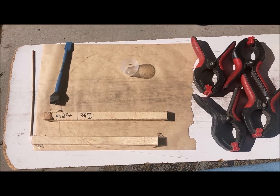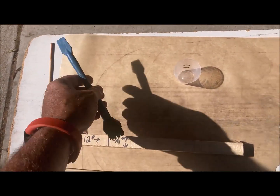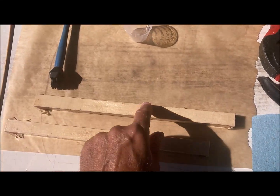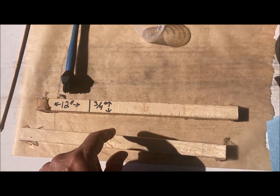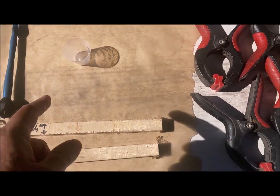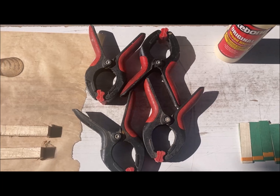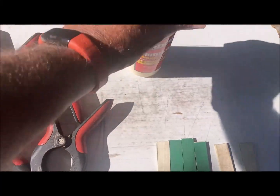Let's look at what we're going to need today to clamp up our logs. I have a brush here. You're going to need a measuring cup. You're going to need a couple of cauls for doing the clamping. Mine are plywood, and so the glue doesn't stick, I have packing tape taped over these. These are 12 inches long by three-quarters of an inch wide — two of those for clamping each log. You're going to need some wax paper to protect your surface, the clamps that I use — I use seven-inch spring clamps. Don't use the smaller ones. And then I'm using Titebond original glue, and of course your logs.